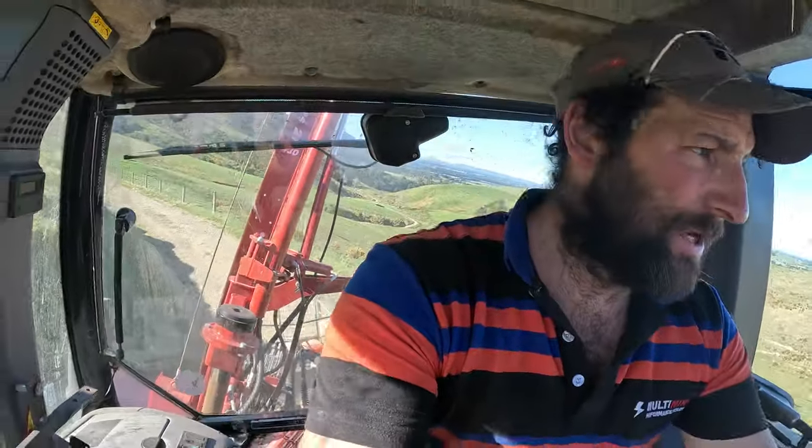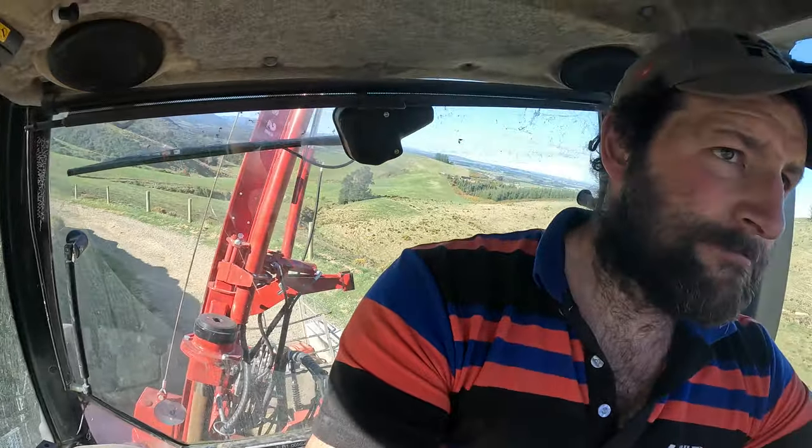Tootling along up the airstrip track, trailer on behind. We had an issue with this tractor the other day. It did the five solenoids for the power shift. So it broke two of them. It was shifting badly, and then actually wouldn't shift at all. It would start jumping and skipping and whatnot. So it must have been going bad for a while, because now it's like new again.